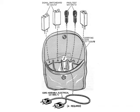Here's an example of the MX-842 maintenance and checking kit that came with the TM-125. You can see it had four patching cords so you could move circuits around. The small rectangular things are actually signal or ring detectors — you could plug them into those little holes and they would detect if you had a ring signal coming in, so you could check ringing on circuits. The two black things were individual spring-loaded probes — you'd put the probe in the hole and the spring-loaded jaws could accept a piece of field wire so you could test circuits. I've seen several of these cases online but can't find one with all the items still inside.